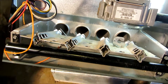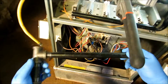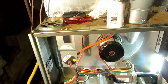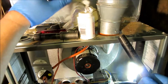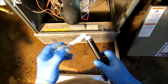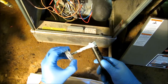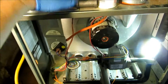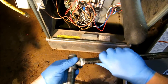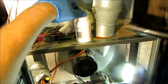Let me get this cleaned up and then we're going to get back to our gas. We've got our burner assembly cleaned and looking good. Now we're ready to start gassing — it just made it so much easier to do that with the gas off. I've already got my little gas assembly made up here. I'm going to take this 12-inch nipple and put a little dope on it. I like to use the Teflon dope. I go a little overkill with the dope, but I can always clean it up. So let's go ahead and take our drip leg off here — we'll assemble that in a minute. Go ahead and dope up our other side.